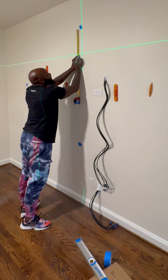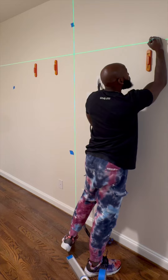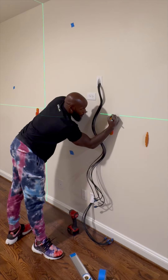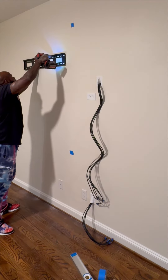I like to write my measurements down. I'll add another stud finder check and then put the tape measure at the top of the tape — I need to be 12 and a half inches below that. Then we're gonna mark each pilot hole. I'll do the top half first, then get the laser level set up 26 and a half inches below and do the pilot holes on the bottom two.